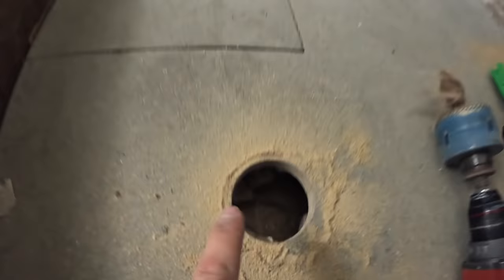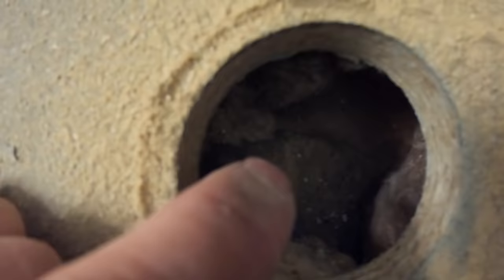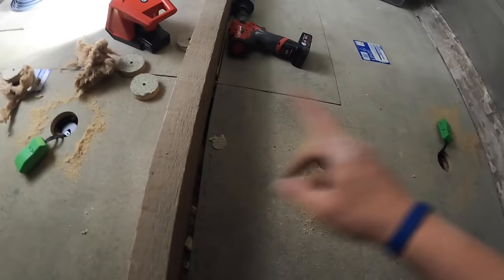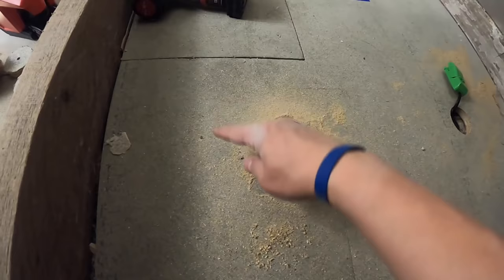So James was poking up the screwdriver, I could put my hand on this flooring to feel it rattling. As you can see there, there's the cables, and that's the original pendant. As we did in the other room, we'll just pull them up, put them into a Wago box, and we'll wire from here. So what I'm going to do now is link these out. I'll probably go these two linked out back to here, and then we'll link these two out back to here. Then we'll just have a joint here with the original cables and our two new cables for these spotlights.